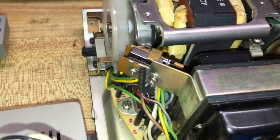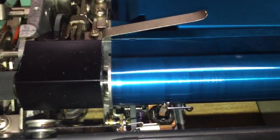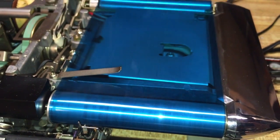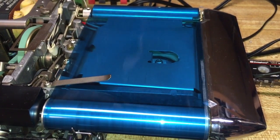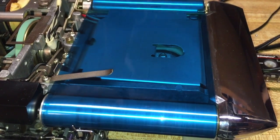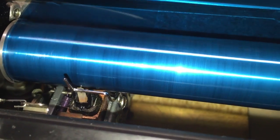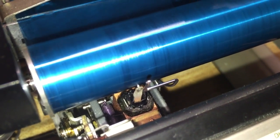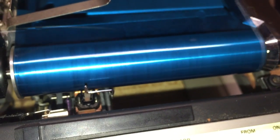Now this unit actually does embossing, in comparison to my record cutter, which you've seen on my channel, that leaves swarf behind because it's actually cutting material out of the record. In this case, we are embossing a groove onto this plastic material. You'll also see on my channel a third competitor, a Dictaphone machine that was not made by Dictaphone or by IBM. It was made by Thomas Edison's company, and it uses a round record, but it uses the same technology that this Dictaphone uses. It would emboss a signal onto the recording, and you can see that on my channel as well. It's called a diamond disc Dictaphone or Ediphone machine.